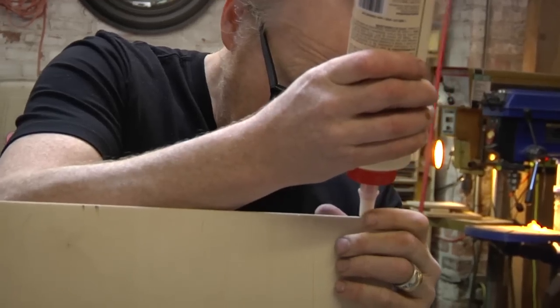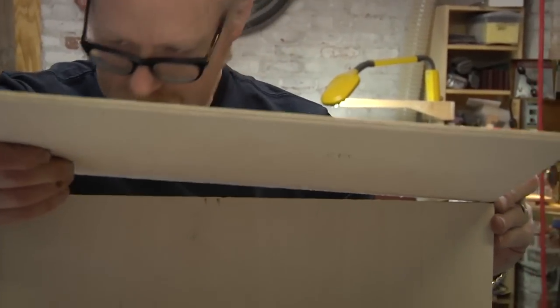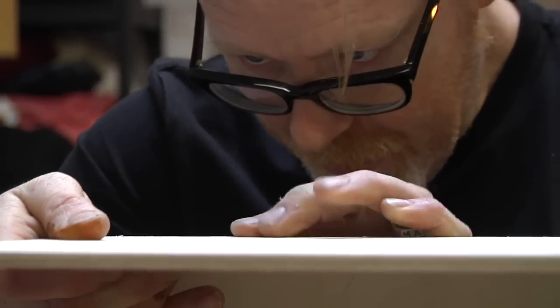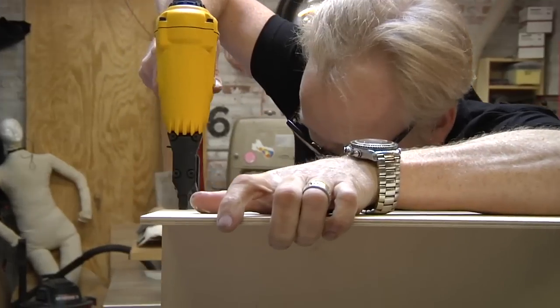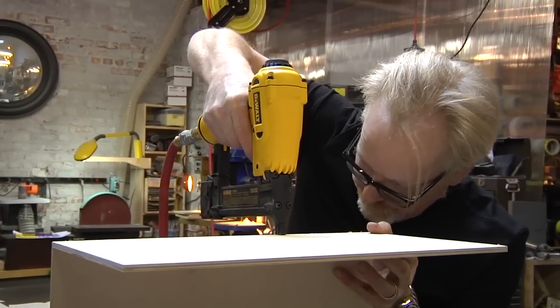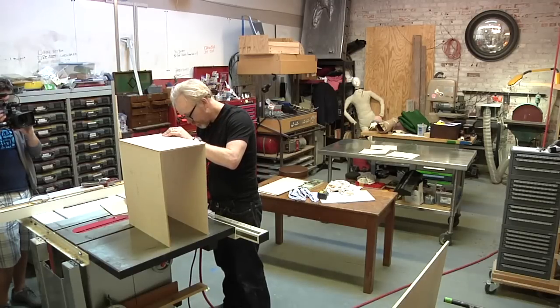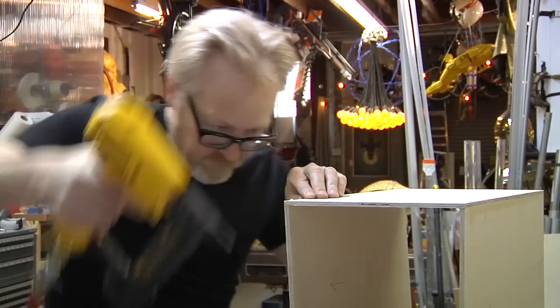I could use biscuits and other ways to make this more solid, but I don't need this to be a hundred-year box — the staples and the glue are going to make it incredibly durable. We're seeing you glue them first — that's just standard wood glue — and then using a staple gun with narrow crown staples, long ones. You have to be careful with these. Some guns will double-fire and take a staple, drive it in, take a second staple, drive it into the first and push it forward. I've been bitten two-and-a-half inches from where I was stapling because the staple got pushed through and hit my finger.